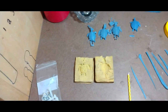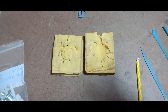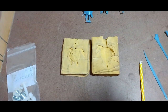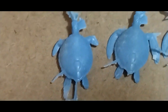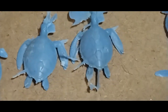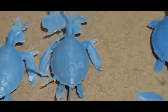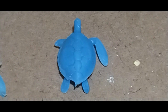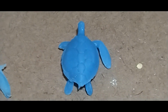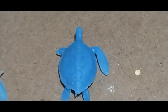Right here is my rubber mold. Now that mold looks really rough, I know it looks terrible, but it does make a nice pattern. These are some turtles I shot out of that rubber mold — you can see they look rough with all that flashing on them. But right here this is the one I'm going to use. This is just one of those after I spent about two minutes cutting the flashing off of it. You can see it looks pretty decent. One of his arms broke off and I'm going to go ahead and repair that. This is my wax pattern that I'm going to be using today to make this casting.